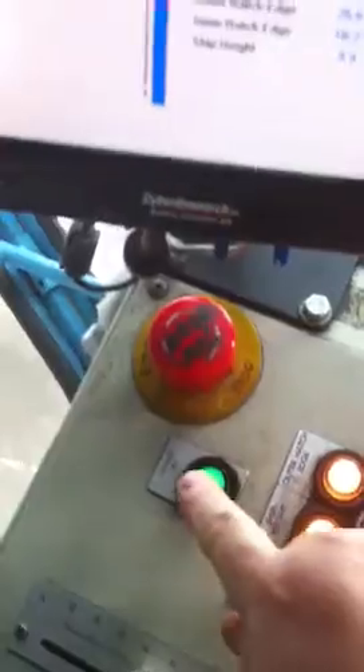I'm going to explain how to do this really quickly. Once you get into the crane, we turn the crane light on — that's the green one right here. Here's the red button to stop it, turn it to reset it, turn on the crane. Then we come over here, hit this handle all the way to the left, and that tells the computer that somebody's in the seat.